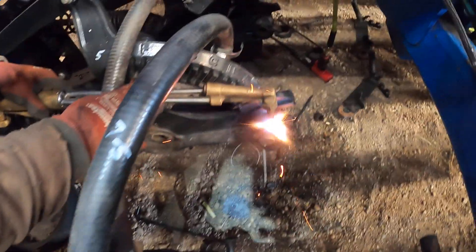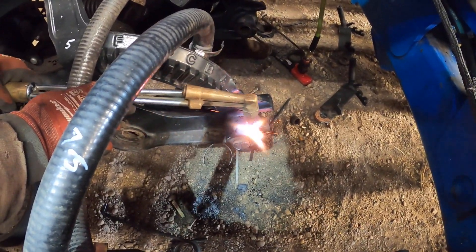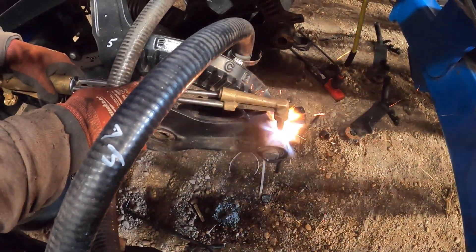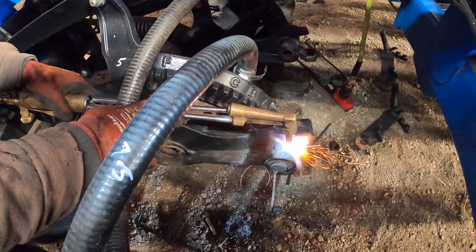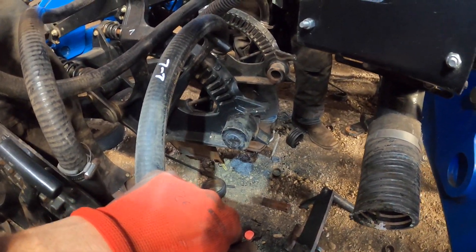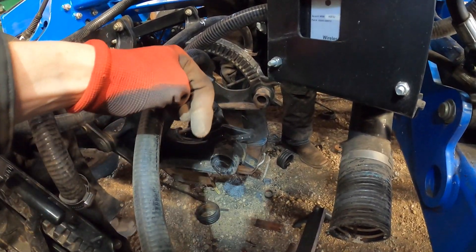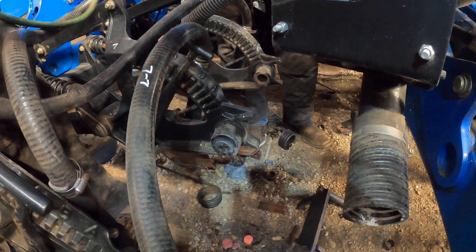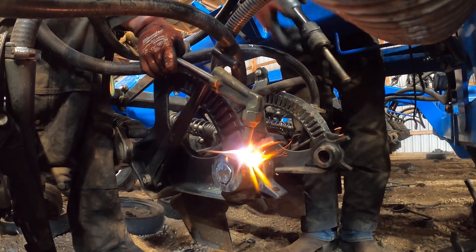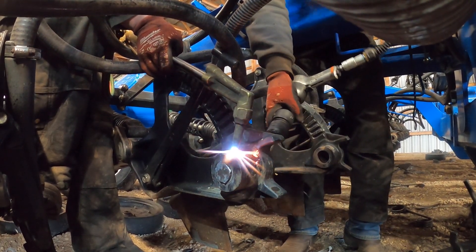Save the spring. We're gonna show you guys the best way to get these stuck pins out. When it doesn't move, you just start to heat it. So this one's really stuck. We've torched the end off as you can see, and sometimes we'll drive it that way, sometimes we'll drive it this way — whatever works to get it out. It's definitely hot in there, burning out all the rust. It's just late coming out of the hole.